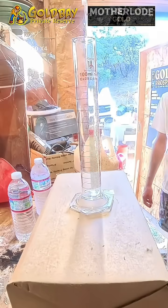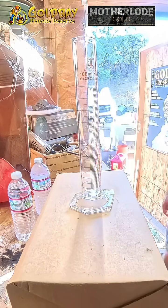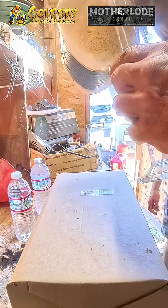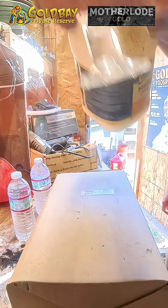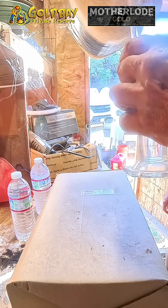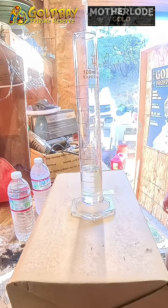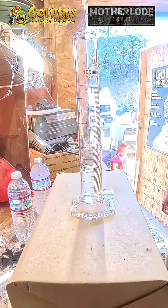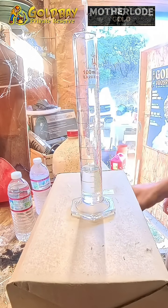The actual gold out of the saw — I'm going to do a 10 gram batch, because I didn't really lose that much weight by stripping the silver. We're going to start with hydrochloric acid, which is the first part of your aqua regia solution. It's between three and four parts muriatic or hydrochloric acid per part of nitric acid. You use approximately one gram of nitric acid per gram of estimated gold.